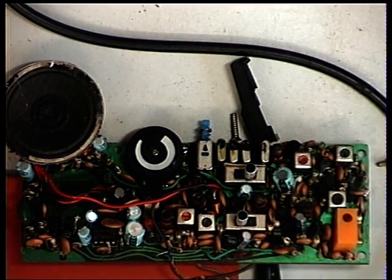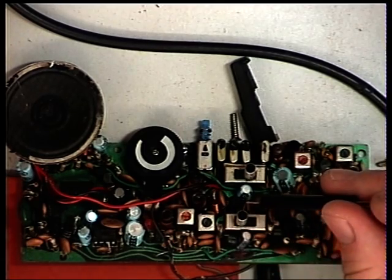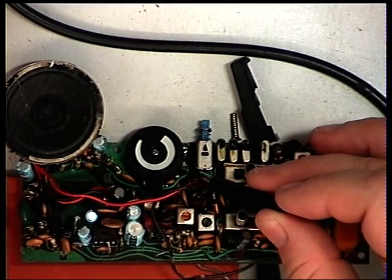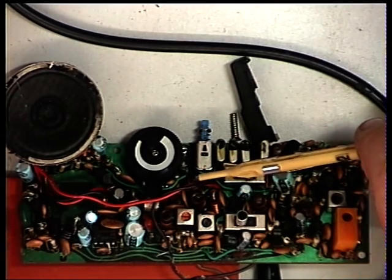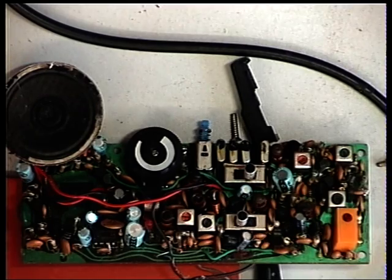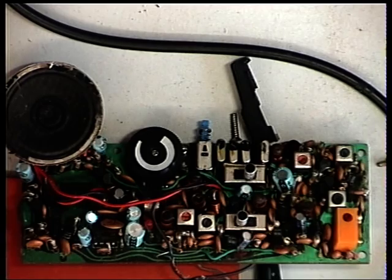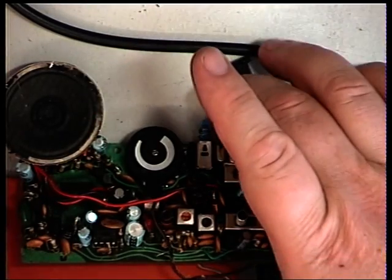What you have to do is connect your test equipment to the input side of the loading coil transformer - one is a loading coil - and we'll be adjusting that when we come to put the telescopic antenna back in the case. You have to go to the input side of that, otherwise you'd be doing it through the loading coil, which would be totally wrong.